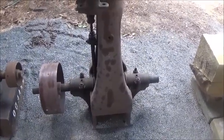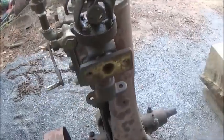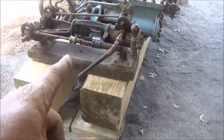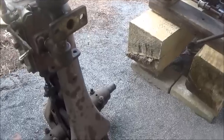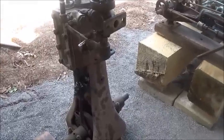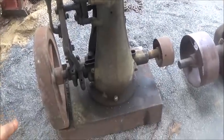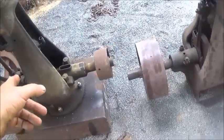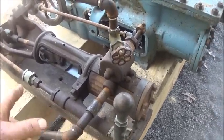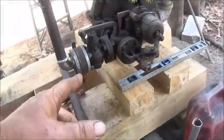This engine here was for a blower, and I'm hoping to have it fully moved in and a belt on it before we fire. I've got an oiler coming - hopefully it'll be here today. I don't mind running them shortly because I put oil in the system before I hook the pipes up, and I just don't want to run them for very long. This one's got a knock that I've got to try to adjust out either the day we fire or before. I want to run this one for a little while and let it run - it's been sitting for a lot of years.